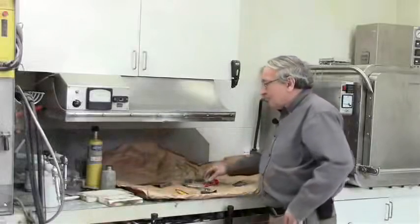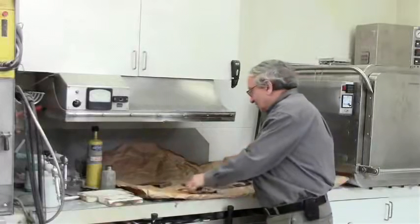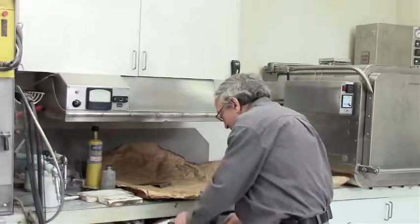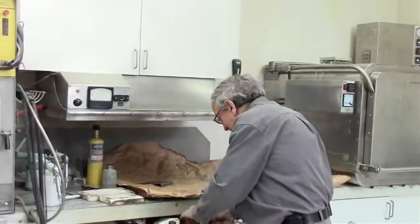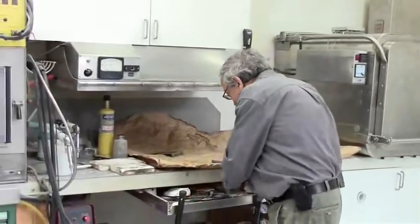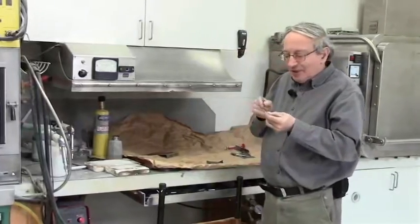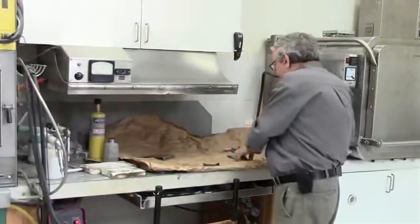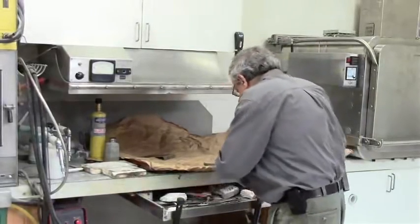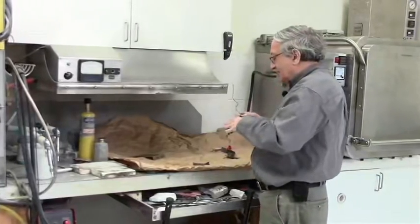So after you prepared the surface, you electrostatically paint it, and the best thing to do is, the reason why I suggest electrostatic painting is because it's done with powder, so there is no cleanup issues. Because if you paint it with wet paint, which works fine, there is cleanup of wet paint, which is a problem. So what you need is to hang it from a grounded surface.